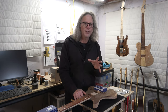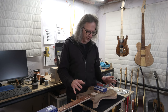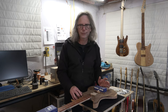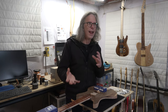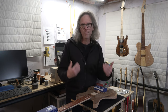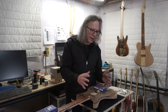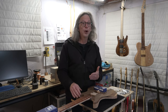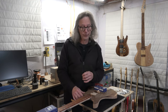And sometimes the damage isn't that visible. You'll have a nice glossy finish on your guitar, but then after you've done all the assembly, you'll look at it and you'll start to see all these scratches all over the surface and you'll wonder, well, how did that happen? It happened because of the rough handling that typically occurs as you're trying to drill holes and mount components. So I'm going to do a pre-assembly first, and then I'll take everything off, apply the finish, then I'll do the final assembly, which will happen much faster and is much more gentle on the finish.